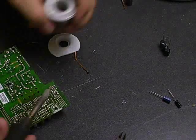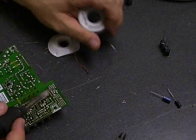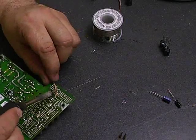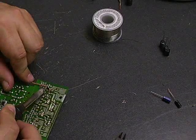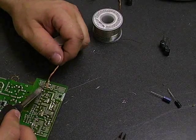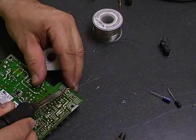This one wants to be a bit of a challenge to get off — it's in a tight location right by the power connector. It is a little bit more difficult because you can't really grab a hold of the capacitor to wiggle it and remove it. You just have to make sure that you get the connections clean and try to remove the capacitor that way.